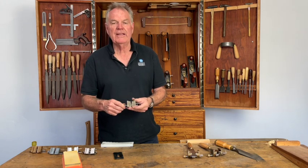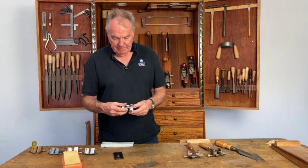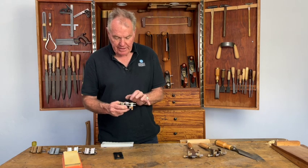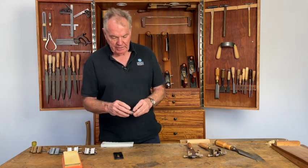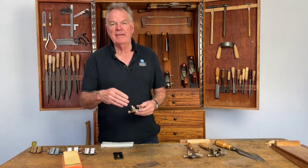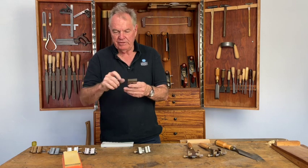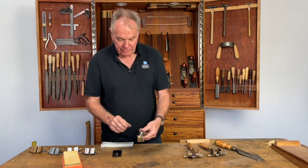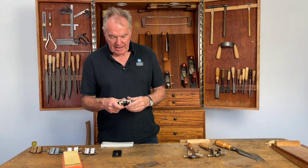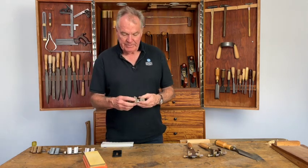The better quality machining has made this a very nice tool to use — nice and smooth, silky movement in and out. I've increased the roller width from 12mm to 15mm, which still allows you to apply different pressures left or right if you want to put a curve on your blade to avoid tram lines when planing. But being a bit wider, it's less likely to create a groove or furrow in your waterstone.